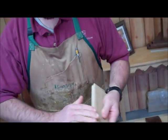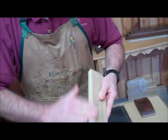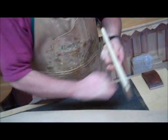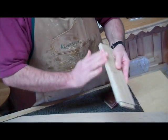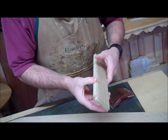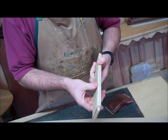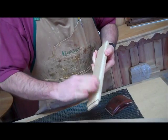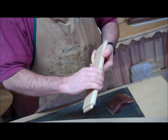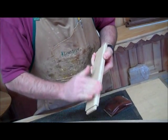Any other edge though — any edge that you can touch — you'll want to sand and ease. Ultimately, any edge you're able to touch shouldn't be sharp to the point where it hurts you or bites you. It should be pleasant to touch. You should want to touch the piece, so make sure you ease those edges.